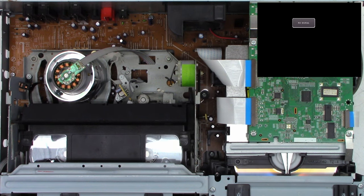I know my hand's going to get in the way. So grab it, squeeze it, push down very gently, and just rotate. And then it actually fatigues the leads of the capacitor, as you can see right there. And then it will just lift off of the board. I know my hand's right in the way, but just a couple of twists and the capacitor is off of the board with no damage to the board. I don't think I've ever damaged a board using the twist-off method.